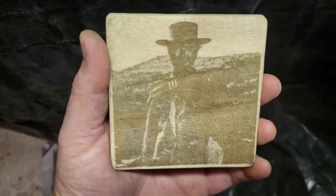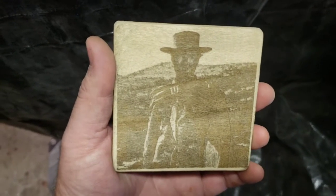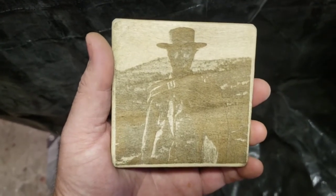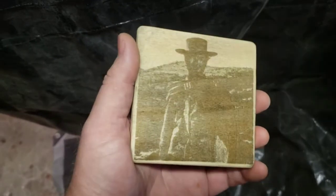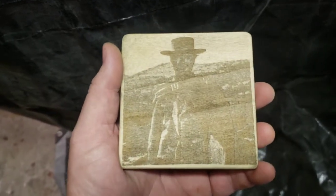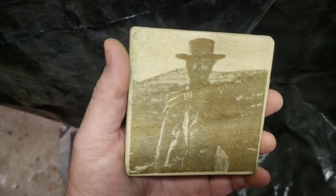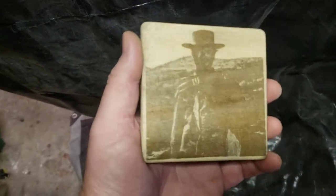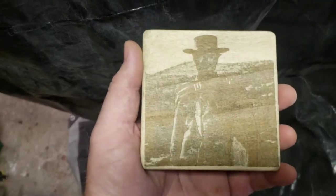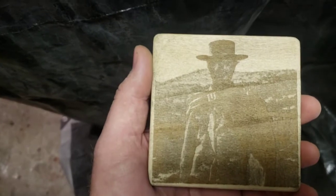Here's that same image after I brushed it off. I kind of thought it looked a little dark and I was probably still running a little too hot. After I brushed it off, some of the details kind of brushed off with it. That's kind of the problem with pine like this and cheaper woods — the grain. Some grains take the burn better than others. You can see this middle grain kind of streaked a little bit more than the grain at top, which took the laser pretty good.